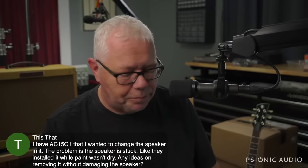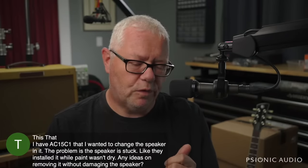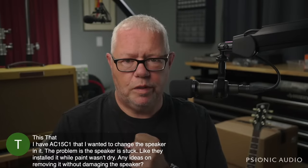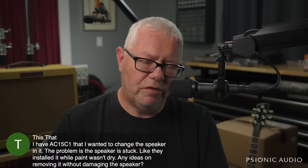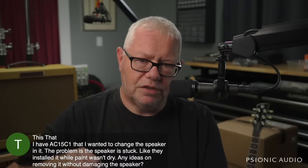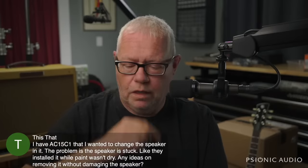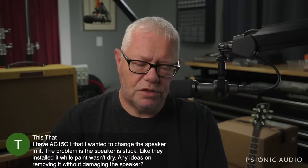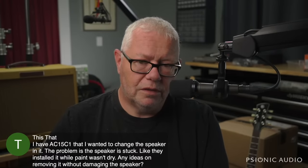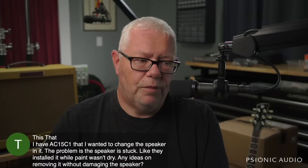Welcome to my life. Yeah, a lot of companies out there install speakers and install rear panels before the paint is all the way dry. If I get an AC15 in with a stuck speaker like that, I go get a very thin painter's knife, and I just kind of slide it in from the side, you know, a thin, flexible one. You can use a plastic one, you can use a metal one, but once you break the seal, it'll come up. You got to break the seal, and you may lose a little bit of gasket, and you just hope that you don't.